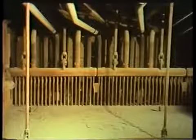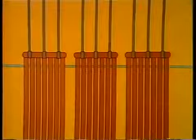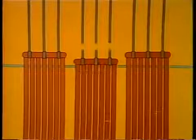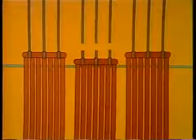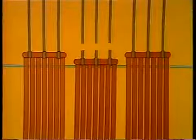Now, the next problem, support failure, shows up in the water walls as vertical misalignment of its tubes. Water walls are attached to headers that are usually hung from the top of the boiler. Now, if the supports holding up a section of the wall break, that section will sag. And if that happens, you'll see a section of tubes that is lower than the others. It's important to check this out because support failure could lead to the collapse of the entire boiler.